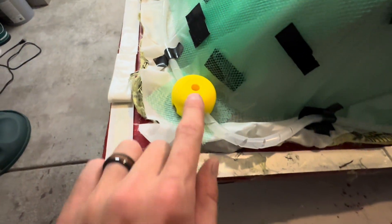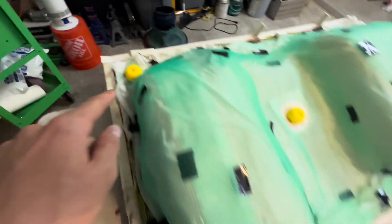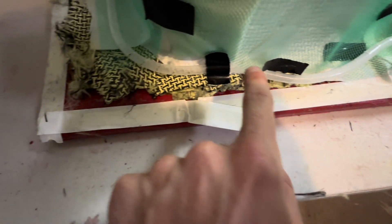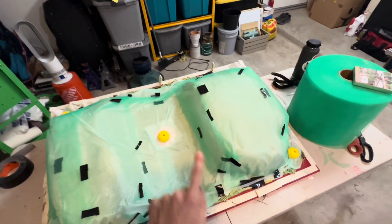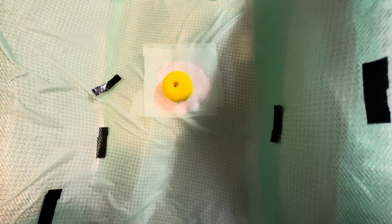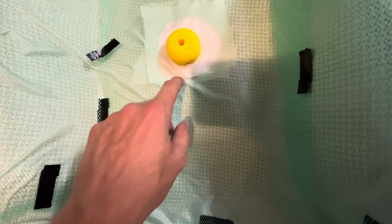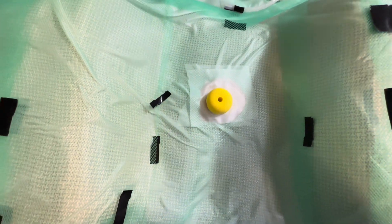We 3D printed these tubes on Friday, and those tubes are taped on. They're corrugated to allow resin to come out of all the corrugations — or spirals, whatever you want to call it. I'll have one and two inlets and then the vacuum will be hooked up to the center one. I took away some of the flow media around the exit just to try and slow down a bit of the fluid from the flow medium, to give the rest of it a chance to all get to the same point at relatively the same time.